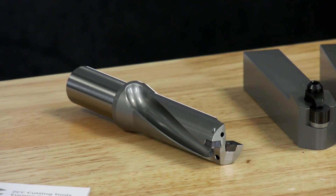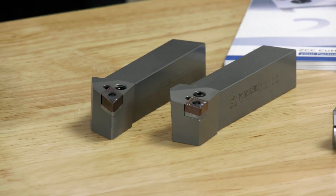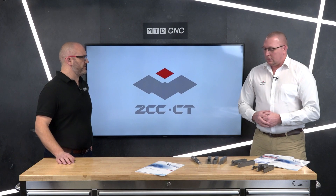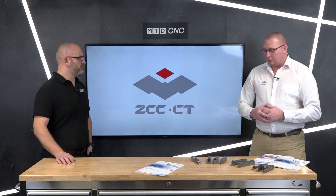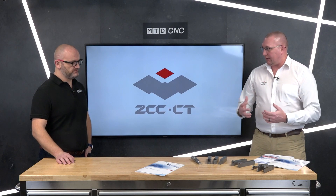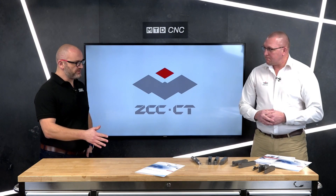Yes — for turning, with our additive-based products called YBSC, they are actually an S10 but we use them in a roughing function, so machining in the S25 to S35 kind of territory. With this you're getting the rigidity of that insert but you get the wear resistance of that grade. It allows us to have a wider spectrum of application, so we can do out-and-out roughing with intermittent cutting, but when we need to semi-finish, we can increase the surface speed considerably and have one solution for all, basically.